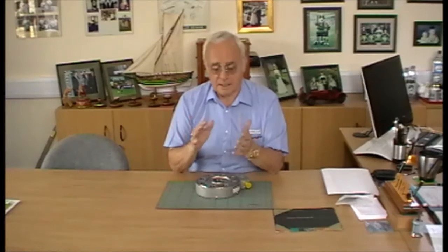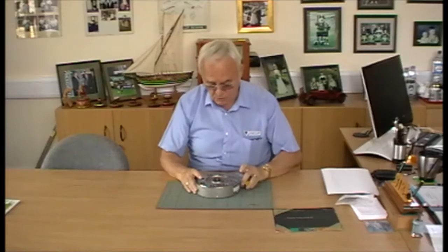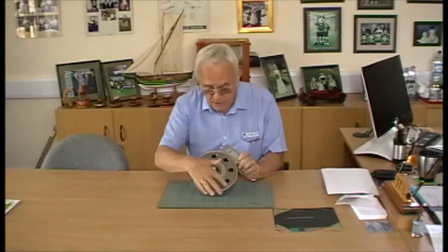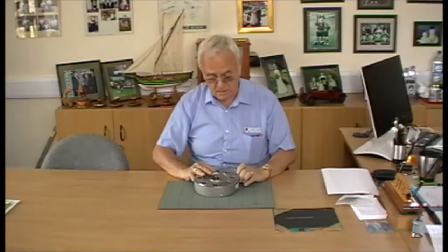The only way to prevent that is to really limit the movement you get within the load cell. That's where I'd like to introduce you to this range of load cells — our fatigue-rated range. It consists of two rings linked by a diaphragm. This diaphragm is quite thick, probably three to four millimetres thick.